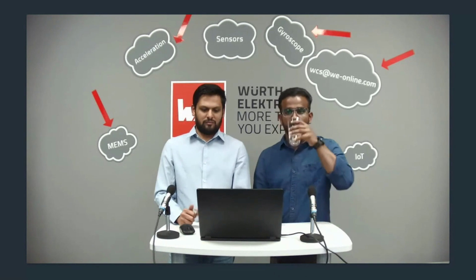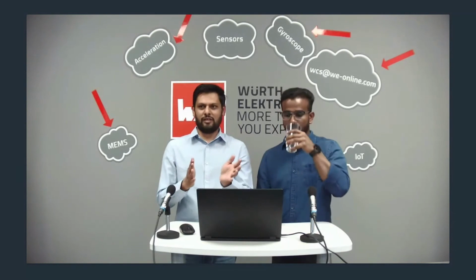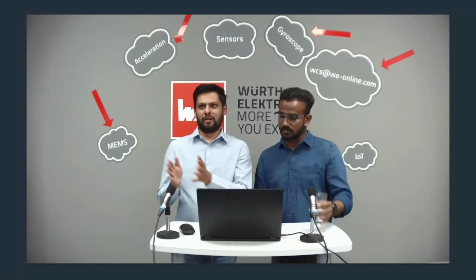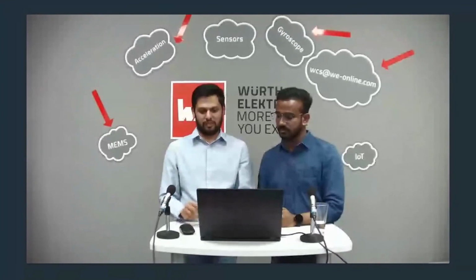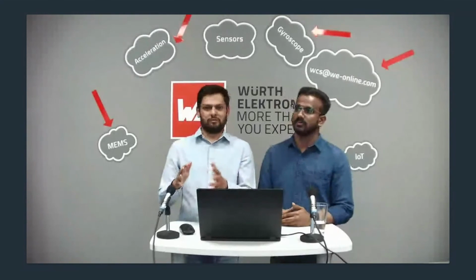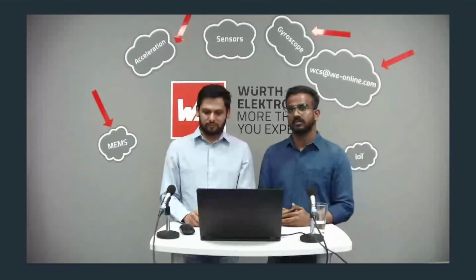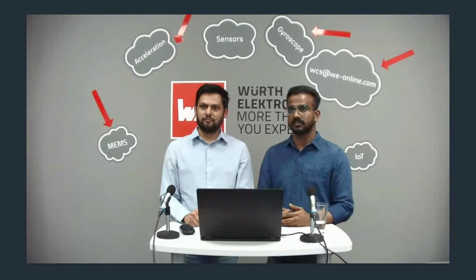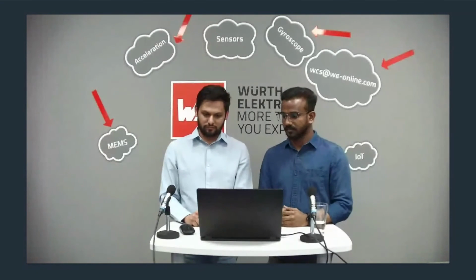Will there be an integrated sensor system? Maybe, Mantha, just to the previous question. Sure. The sensors that we have are already giving you a digital output. So you don't need to have one more ADC after the digital output. So basically the signal is first amplified, then passes through the filters, is converted through an ADC into digital form, and then you read it out. So, you had it in the slide previously that the digital output is 14 bits wide? For 3 axis, and for 6 axis, 16 bits. 16 bits. Okay, lovely. Thank you.